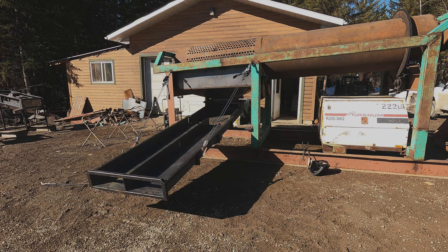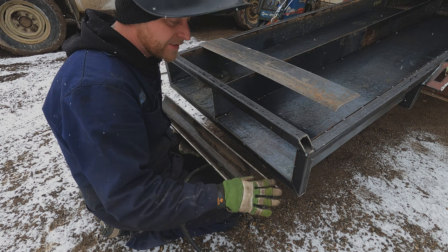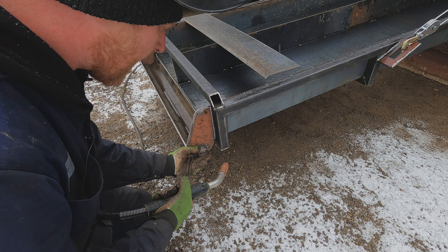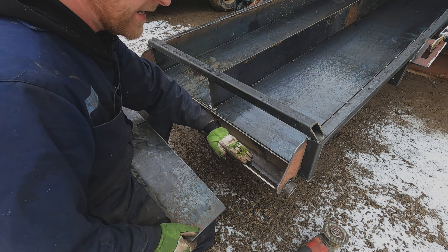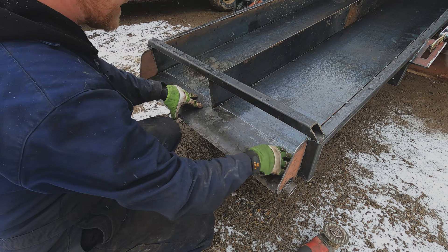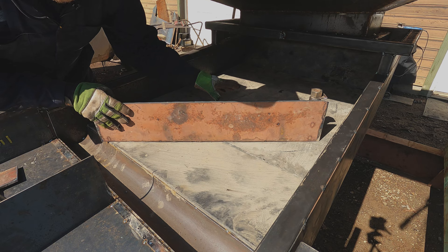At the very end of the sluice box I'm going to add another half piece of pipe. When I spray out the sluice box it goes into this trough and then it'll have an output on the side. I'll also add a one-and-a-half inch MPT so we can cap it off while we're sluicing to prevent a rooster tail of water coming over the matting and kicking upwards. I just cut out a small plate — we can cap this off during our run, and the miner's moss will actually overlay it. I'll just add one fastener at this point.